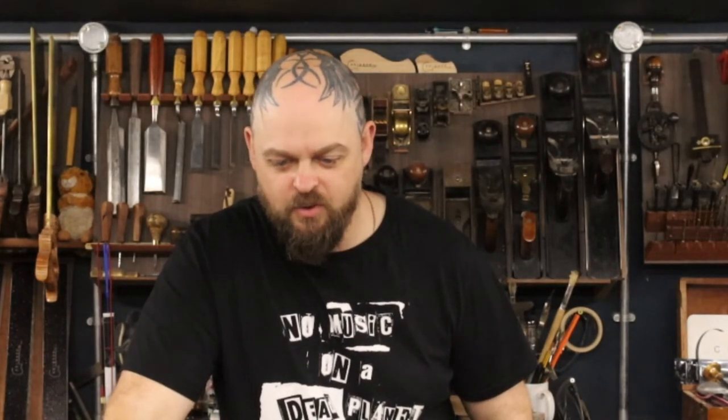Brian Thomas, Black Dog Vintage Racing. That sounds fun. Can you stain a fretboard darker? 100%. I would go with the Stunning Stains Spirit Stain probably. I think that goes in deeper, but also, on a fretboard, I would be worried about the water-based stain. The spirit-based stain off-gasses quite rapidly and doesn't leave things wet, whereas a water-based stain is water-based, so you're putting a lot of fluid on something that's already thin. And if something goes wrong and it starts moving, I wouldn't suggest using it on a neck, on a fretboard at least, sorry. Interesting question. But yeah, spirit-based stain, and have at it. You'd be fine.